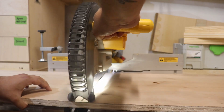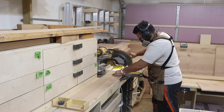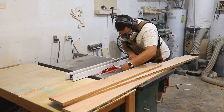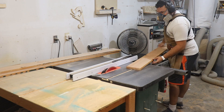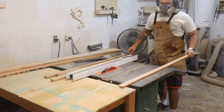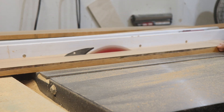I'm cutting the sides of the bed, the headboard and the footboard, all out of plywood. The idea was to trim the plywood with the knotty alder — you can see the four-quarter alder up top left. I'm cutting it to about an inch and a half, with the idea of having a three-quarter-inch reveal, which will make sense as you watch the video.